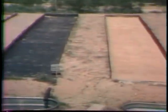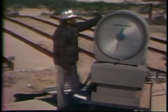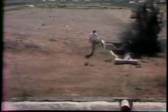Many other surface materials for catchments are being evaluated. These long-term research studies measure the amount of runoff from various materials after each rainfall. The effects of wind, sunlight, and temperature are carefully observed. Among the surfaces being tried are metal foil, gravel over asphalt, concrete, artificial rubber, paraffin wax, and gravel-covered plastic. So far, no single ideal catchment surface for all conditions and locations has been found — soils, climate, and costs are too varied. But research has proven that water harvesting works. Treating a surface to increase runoff from rainfall will provide water, often in large quantities, without requiring fuel or power.